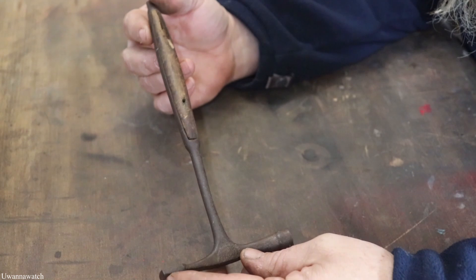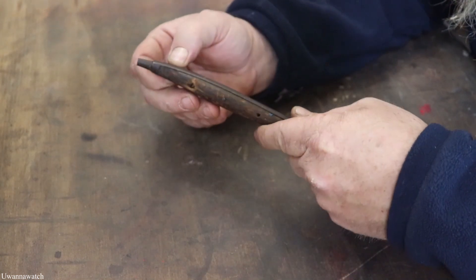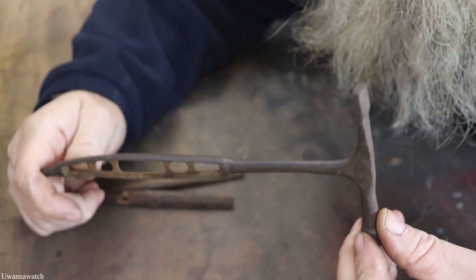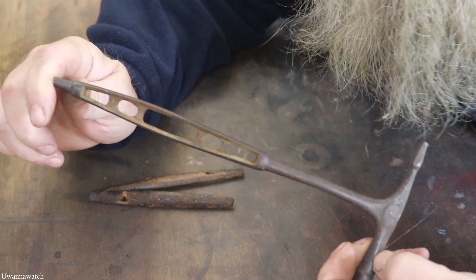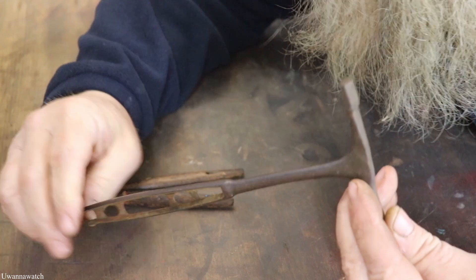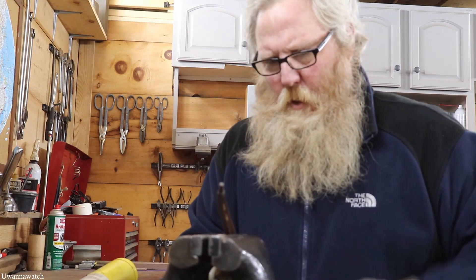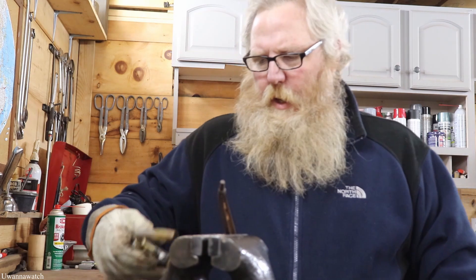I'm always in need for a little tack hammer — I do a lot of furniture and this is gonna come in handy. I'm going to pop the scales off here, which is no real big feat, they're just gonna pop right off. Then I'll throw it in the vise and get some heat on there, see if we can torch it, heat it, and bend and manipulate it to how we need it.